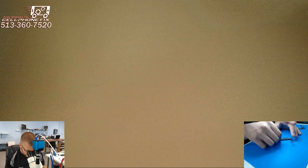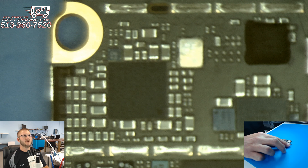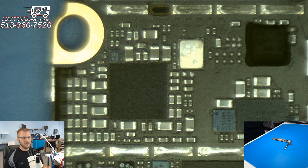Got the ultrasonic cleaner — the board ran through the cleaner and it definitely looks clean. Let's take some diode readings and see if we're back to normal or not. This is our bad board and this is our donor board — which has a shifted cap. Diode mode, red on ground, black on the non-ground side of the cap. Starting with the donor board: we've got 0.268 and 0.334.